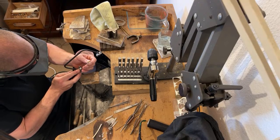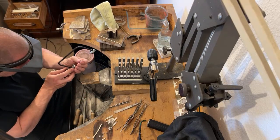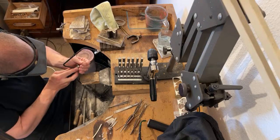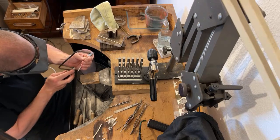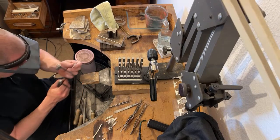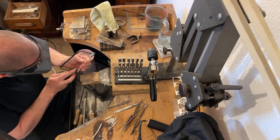You have to take them off every few you go. If you keep going, you end up putting a saw cut on the inside of the top ring eventually. Three or four at this thickness is about all you're going to do. You've also got to be mindful that you're not sawing the steel rod, because it's just going to blunt the saw blade. You'll probably do more harm to the saw blade than the mandrel trying to saw it.